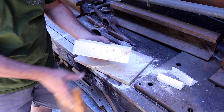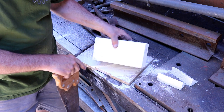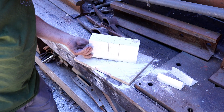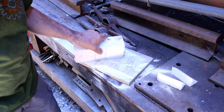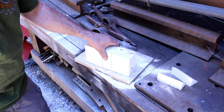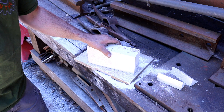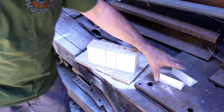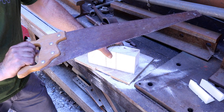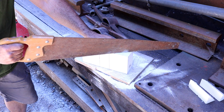This is the fire brick I'm using for the heat treat oven. I've traced out my pattern on it right here. This is not the real hard type fire brick — this is the softer stuff, but that's what's normally used in heat treat ovens or in boilers. I've used this stuff for years. The easiest way to shape it, as most people find, is a hand saw — the stuff just saws easily. Then we're going to use a rasp.